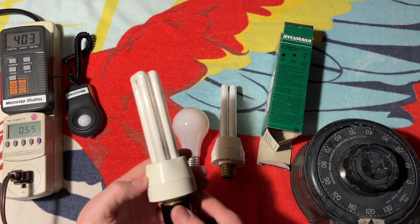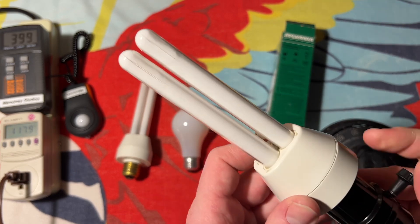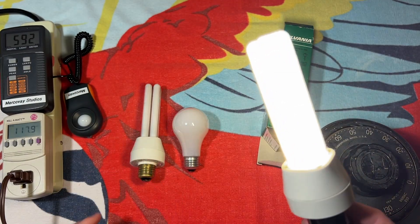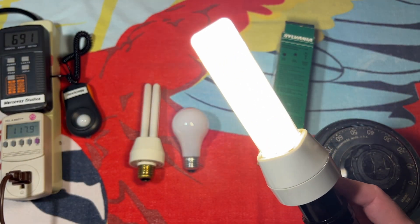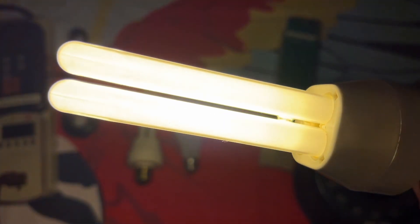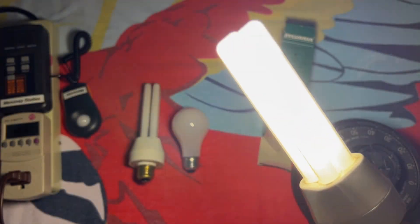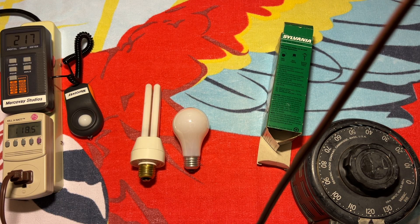Let's go ahead and try out the brand new one and see if we get any type of difference here. Okay, this one's definitely going to need a little bit to get warmed up. I did not warm this one up previously but I can just tell by looking at it that this side is definitely brighter than the opposite side. However, just watching it here it is definitely warming up quite quickly. No end blackening on this one — it's brand new. We still have our little weld there between the arc tubes. Again you can see the mercury discharge in there. This is most certainly a very instant-on bulb — no waiting around here. We're at full brightness; it's kind of hard to look at actually.